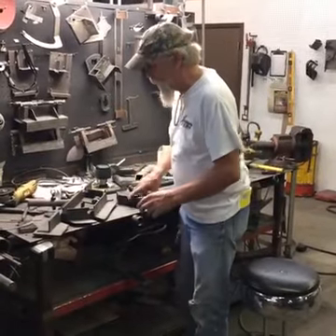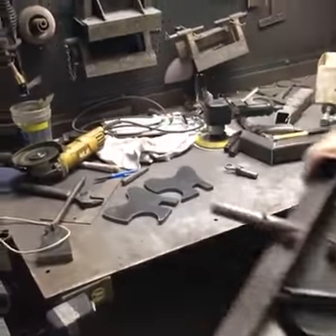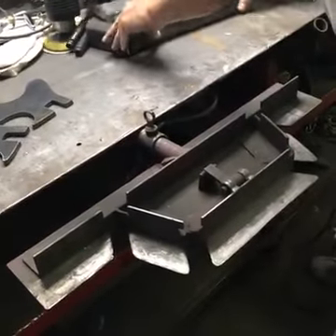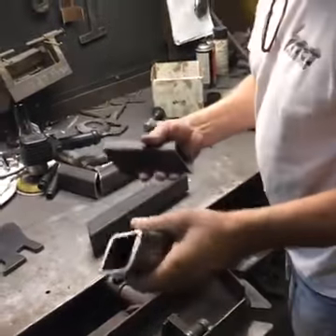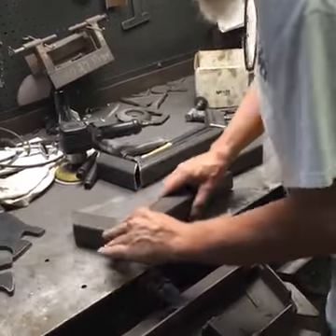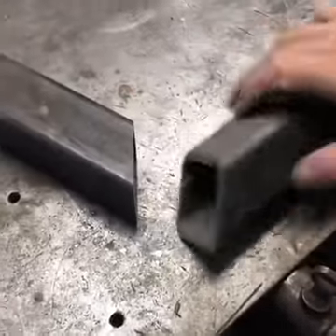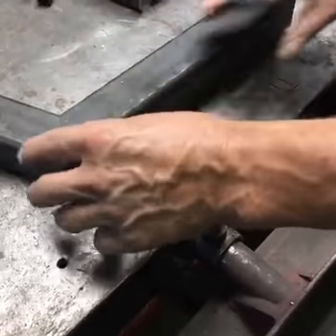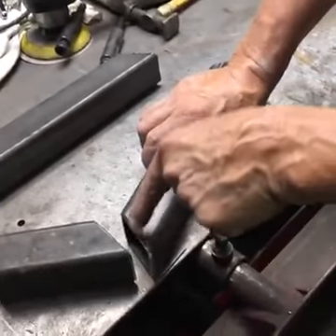So to get a good weld, if you want to come in here — everything's straight. To have a jig is really nice. We build a lot of these cars, we built a jig. This is a transmission crossmember. This is just the parts that are cut up — we've got nice angles on it, the way they're supposed to be. But if you look in here and you just butt them together and put a weld on top of that, you've got 3/16ths of an inch of unwelded metal with just a weld on top. So to get a good weld, you have to V it — you're only going half of it.